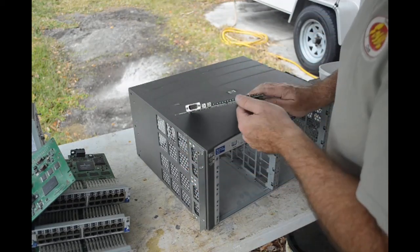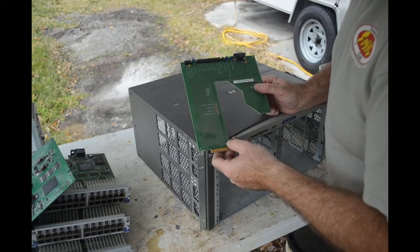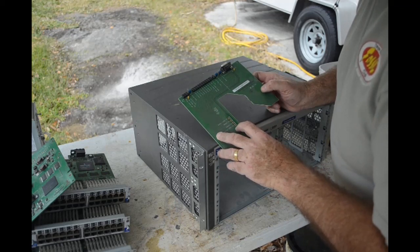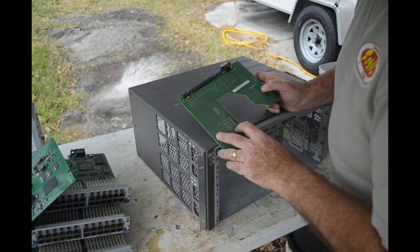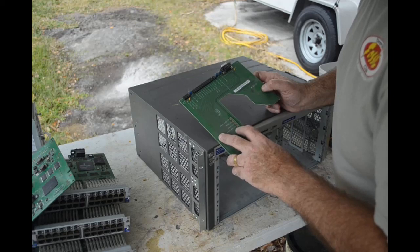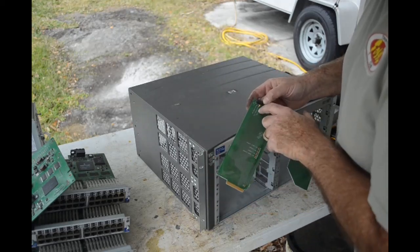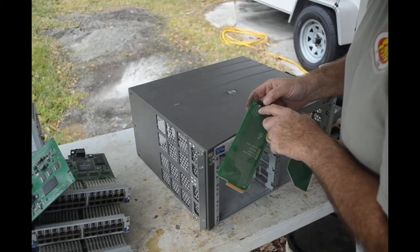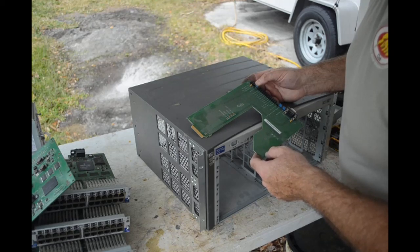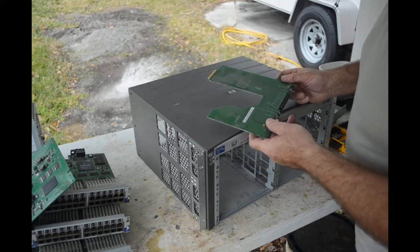This board has a lot of LEDs on it, a couple of switches, the console port, some gold fingers over here, and what look like some gold pads. There are unpopulated debug LED footprints — they didn't install those since this board didn't need any debugging. There's also a 'max speed LED' footprint not installed — that must be a feature available on a different model but using the same daughter board. Not much here but a little something.